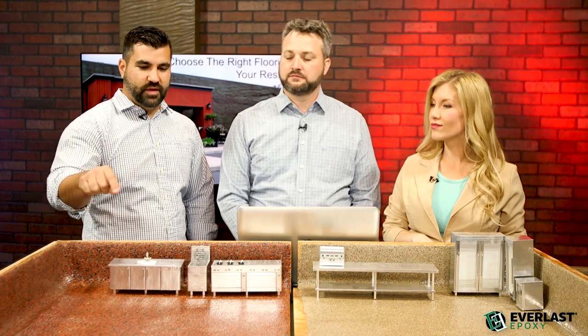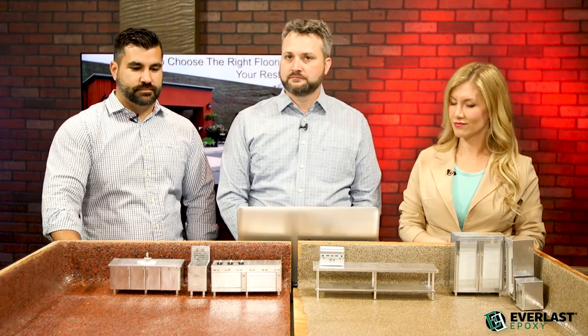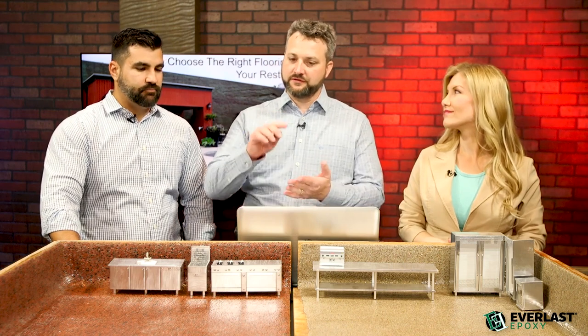That is probably a big question, especially if you're talking about a second floor with a wood substrate. There's going to be some movement there. Fortunately, our floor is able to withstand some movement — it has some flexibility. It's still hard, but it can go over a wood subfloor with something heavy on it. The substrate itself would have to be durable enough, but once you've got that figured out, the epoxy will hold up. Unlike other epoxy floors, the resin goes all the way through, so you actually have a 100% solid hard piece of 3/16ths of an inch. A floor that can handle that weight — a 2,000 pound oven, you can roll it back and forth on there.